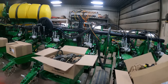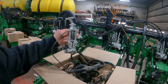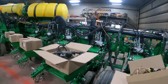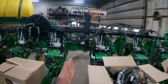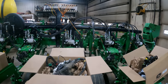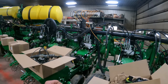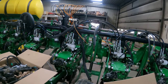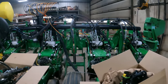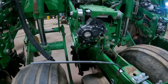What they're doing with this product improvement program is replacing the sensor - the little T-handle unit that goes down on the closing wheels. There's a sensor on that, and each row senses how much downforce it has - either going to it or how much downforce it's actually reading. These units have had some problems with connections, and they're replacing the whole wire harness for each row unit.